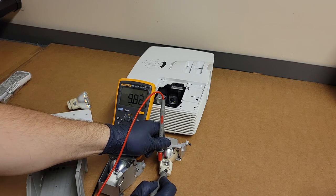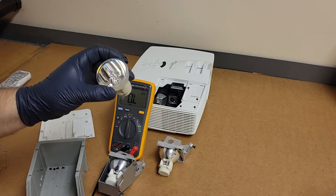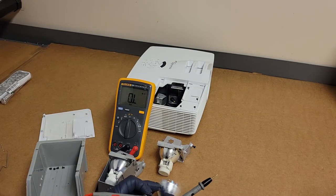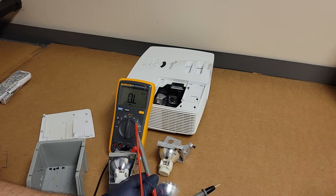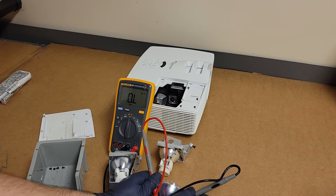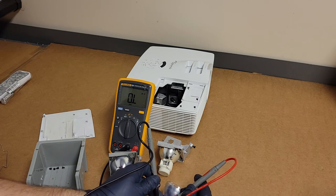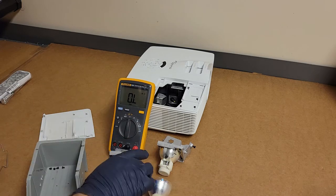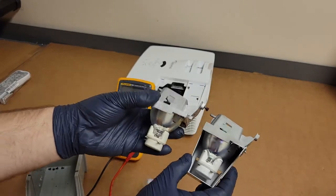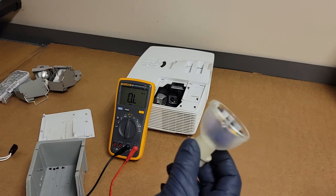Take the wires off in case it was something with the connector. 6.7 — that's weird. So it's not shorted to the casing. But if I go across, it's like it's building up capacitance. Technically I guess it's an air capacitor, but it shouldn't be. This looks like a good Osram. If I go to the contacts on that — nothing. I'm going to switch the probes just to show you it's being tested every possible way — yet nothing. These should not be measuring any sort of resistance.